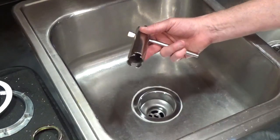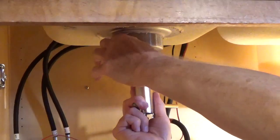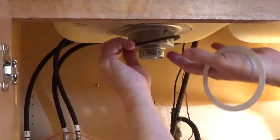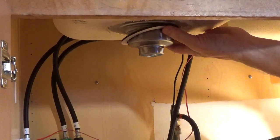I'm going to be using a sink basket wrench to hold the sink basket in place. Wipe off the excess putty underneath the sink basket. Put the rubber washer under the sink basket first, then put on the friction ring, then screw on the large nut.